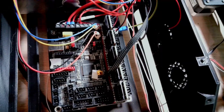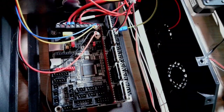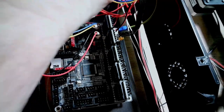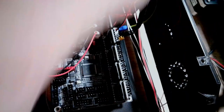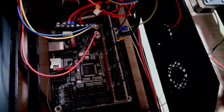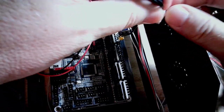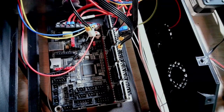I've moved my camera a little bit. The X stepper motor connector goes here — luckily on my Ender 5 Plus these are all labeled. I go ahead and insert that. Next we're going to do Y: I bring the Y wire back here through the bottom of the cable entry hole. The next slot here is Y, and I have that installed.